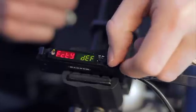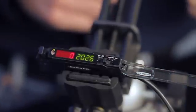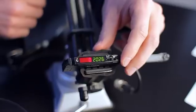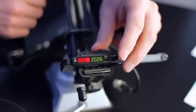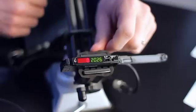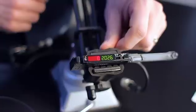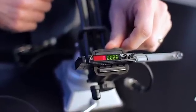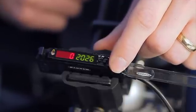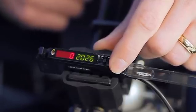Next, we'll slide the switch to adjustment mode. Adjustment mode is used to teach the amplifier and manually adjust the threshold. While in adjustment mode, a downward press on the rocker button initiates the currently selected teach or set method. You no longer have to count button presses when selecting a teach method, nor hold down the button during a dynamic teach. The first button press always starts the selected teach or set, and the second button press completes the selected teach method.